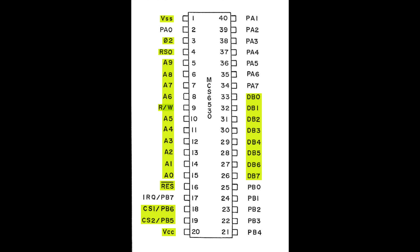That's why we'll also need to connect the ROM select pin RS0 and the two chip select pins CS1 and CS2. Those will be used as additional address lines. We've talked about all the technical challenges, and really it's not that bad. I wanted you to know this isn't just an EEPROM where you press the easy button and get your data, but we're not splitting atoms here. At the end of the day we really are just wiring up a chip and reading from it. So what options do we have? What do we wire it to and how do we read it?